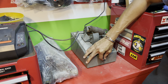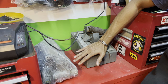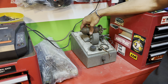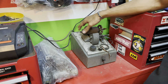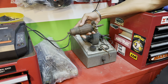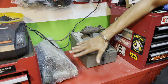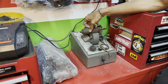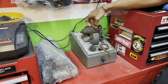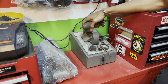This is one of the special tools I use in the workshop — it's among my most treasured special tools, though I rarely use it anymore. This tool is made by Krypton, manufactured in England around 1946–1948. Basically, what this thing does is it lets you test your armature. If you rebuild a dynamo, what this machine does is check the winding wire — your copper wire — to see whether it's neat or not, and whether the electrical path is clean.